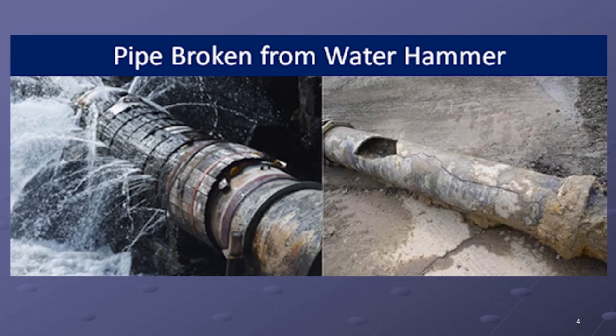The town I live in just recently replaced its wooden water lines, so those kinds of things are out there. We do have a tendency to end up in remote locations where things may be old. So if you're plugged into some sort of a system that isn't your own, watch out for water hammer — but even watch out for water hammer on your own equipment. It's going to find those weak links and break them.